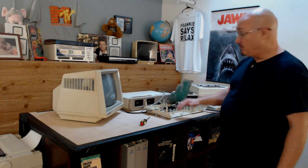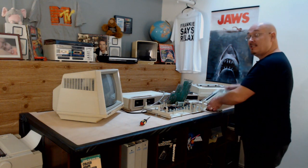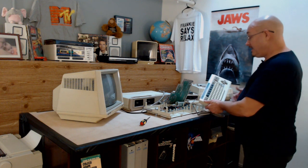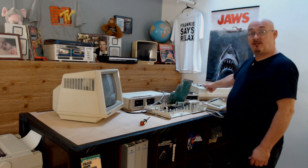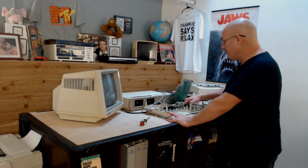It wants to print a character to the printer, it sends out a signal to the printer saying here's a character to print. It wants to see if there's a key in the keyboard, it sends out a signal to the keyboard saying you got a key. Inside the keyboard is a 6801 that's waiting for that signal and it sends back the key presses. Inside the printer is a 6801 that's waiting for the master 6801 to send it stuff and then in turn runs the printer. Elegant little design.